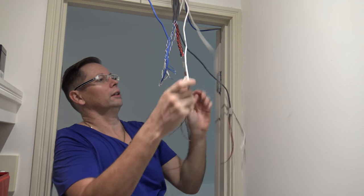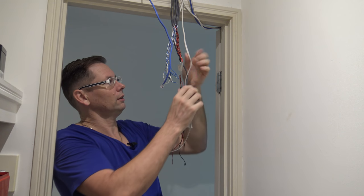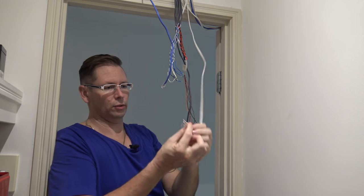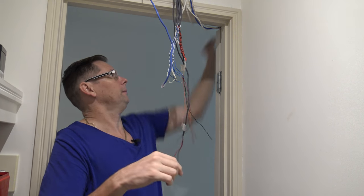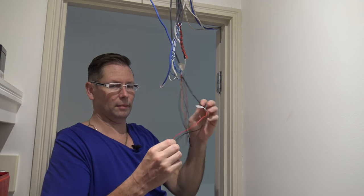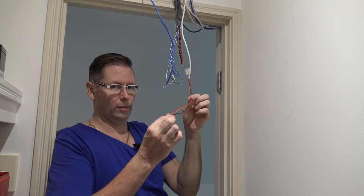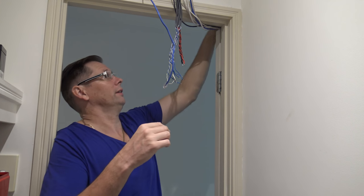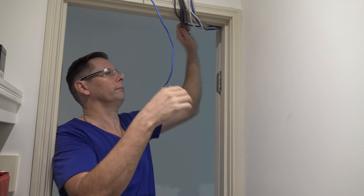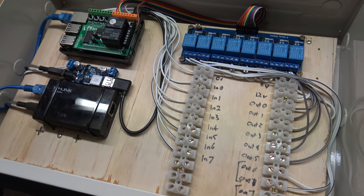This is the little buzzer at the front of the house just to alert me locally without making a big fuss. This is the garage door button — a push button, so if the contacts join it opens the garage door. This is the screamer inside the house for a loud noise indoors. This is the siren and strobe outside for a loud noise outside. And these are the five motion sensors from around the place, plus the network connection with PoE. This is all the alarm hardware before I connect everything back in.